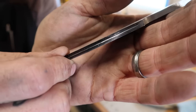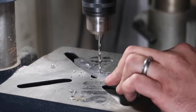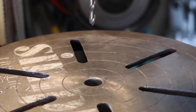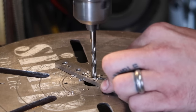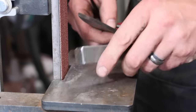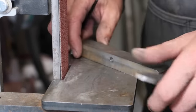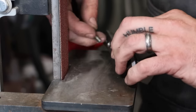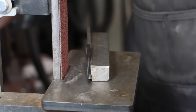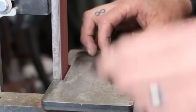For that I just used a knife maker's scribe that I've made — I've got a video on that somewhere in the old video library on this channel. The next step is to drill the holes for our pins. I'm going to use quarter-inch black phenolic pins on this knife, so I drill a couple pilot holes and then finish it off with a quarter inch. In the interest of saving time, I decided I'm just going to use a grinding jig that I've made previously. It's basically a piece of one-inch by three-quarter-inch bar stock, and I machined an angle in my milling machine — a very specific angle for the last ditch Necro knives that I have.